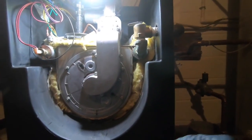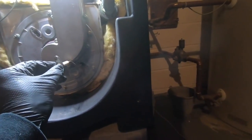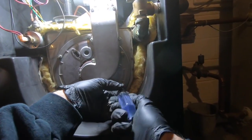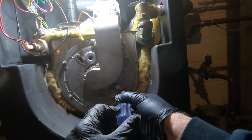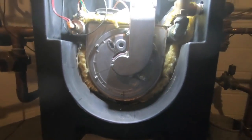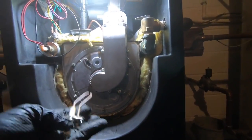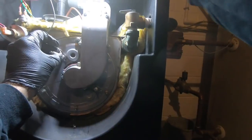It's out again, might as well give it a quick wipe off. I know it's clean, but never hurts. These are hard to get clean. They're always that orangey color. Always make sure your gap is good. I was taught 2 nickels.